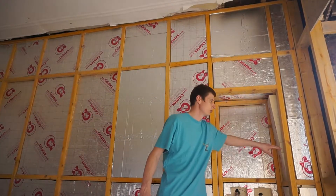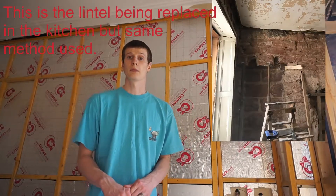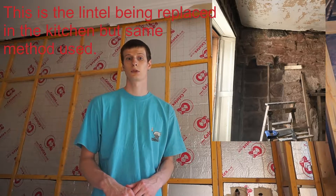So what we've done in this room so far — things I wasn't recording at the time, though I've got a few pictures. We replaced the lintel on this built-in shelving unit just here, which was original. There was a rotten timber lintel across it — woodworm all the way through, it was rotten, you couldn't touch it, it would just crumble to pieces. There was no structural integrity there. So it got propped up, taken out, and replaced with two concrete lintels. Then the props were removed and any loose stones that had fallen apart were put back in place using a lime mortar, which we need to use because of the sandstone.